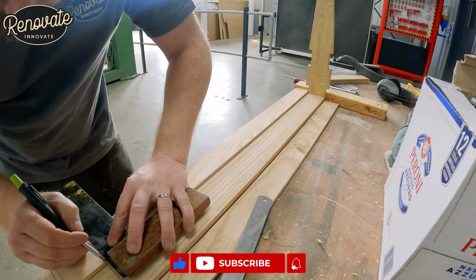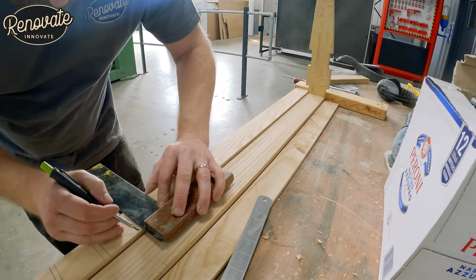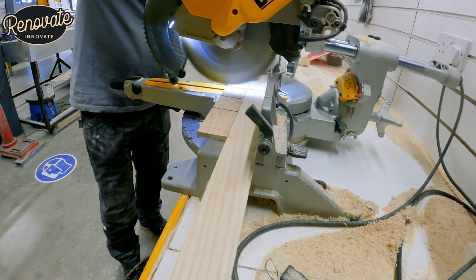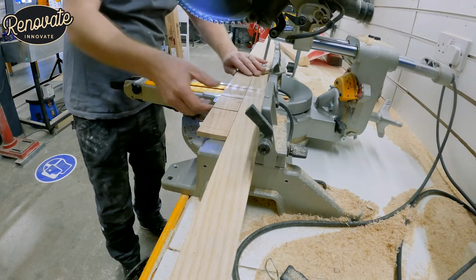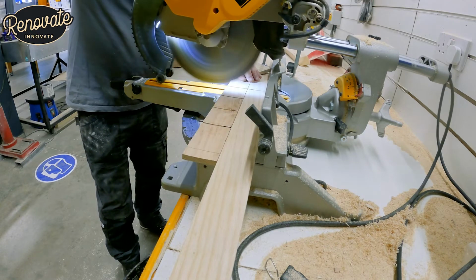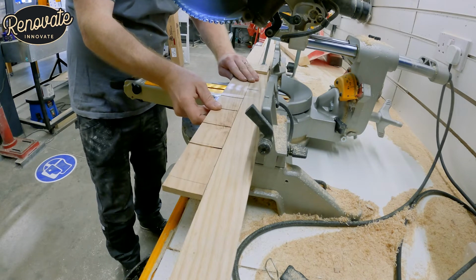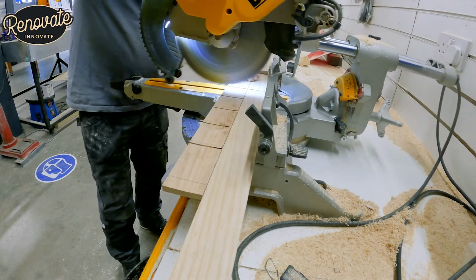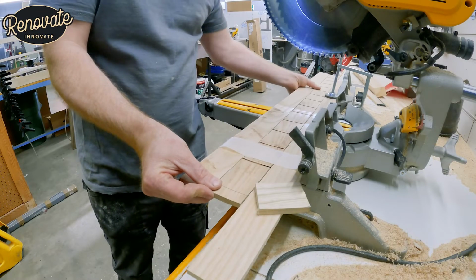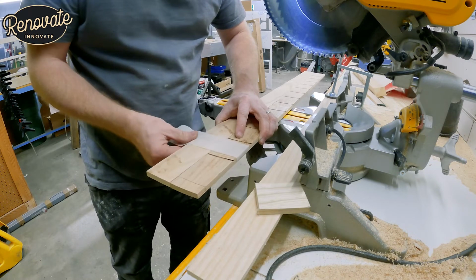The original, we didn't know whether to have holes drilled in the bottom or cut some circles out for the bottles to fit in. But what we decided to do was put some little spacers across the top piece. So here we are, just cutting those out, all mapped out, and we've got a little guide on that rail on the back of the saw, and we're just lining up our lines with that so we get them nice and uniform, and then cut both sides to match. Always recommend doing that. If you've got two things to line up, try and cut them both together.